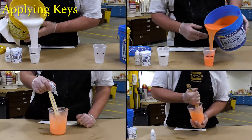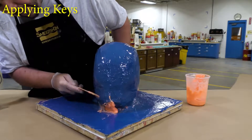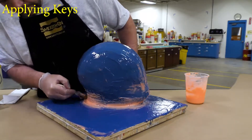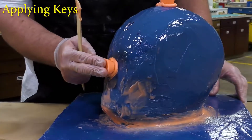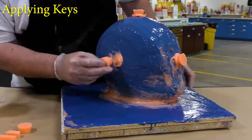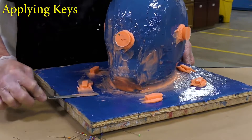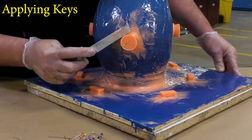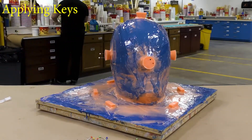To apply the keys we're going to mix a thickened batch of the Rebound 25 using Thivex again. Before applying the keys to the mold, I was a little worried about the sharp edges around the chin area and neck, so I applied a bit more thickened material in those areas to avoid any mechanical locking with the support shell. Once that is applied I can move on to the keys — you can see the thickened rubber stays in place and doesn't slump. I'm going to place a key and use some sewing pins to hold it in place; these will not damage your mold. We then move around and apply the rest of the keys on the bottom as well. Once all keys are applied, go around and feather out the excess silicone around them as much as possible. Allow a partial cure for about 60 minutes before moving on.